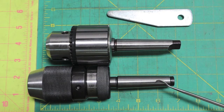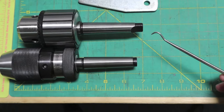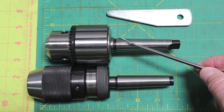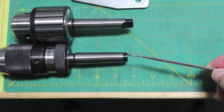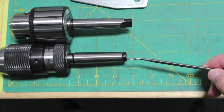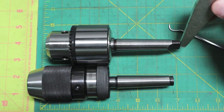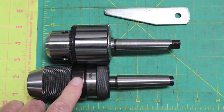And where I got in trouble — I went ahead and did the install and never paid attention to it. Let me lean the camera over to the right so you can see. I lined it up right here; I believe that's where the MT No. 2 probably starts to taper. Right now I'm already about a quarter inch short from exposure in the vertical slots made to use the removal tool. That tool is made to engage the tang when you drive it in — the wedge hits the tang and pops the chuck right out. Works like a dream. So I'm going to insert this back in there and show you what I ran into.